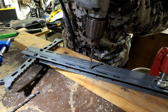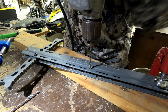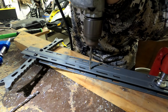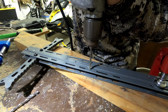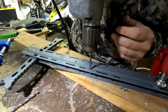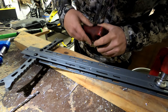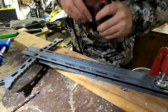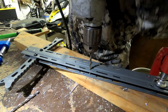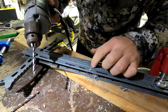Try to be straight up and down with a hand drill — we don't have a drill press, so this is redneck coordination. Make sure you're nice and level. As soon as you break through, give it a rest and back it out. Make sure you're straight down — perfect, all right here we go. When you see the wood chips fly you know you've gone through.